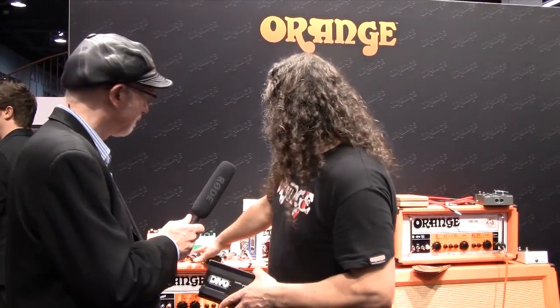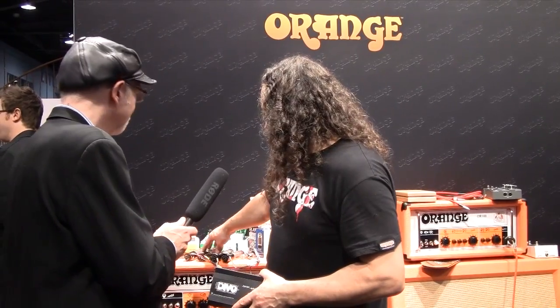Basically, if you've got a two or four socket, 50 or 100 watt fixed bias amplifier, you can install this and swap tubes and mix and match them at will — without having to re-bias the amplifier. Literally in a socket set like this, I've got 6L6s in the center and EL34s on the outside.